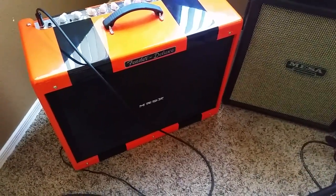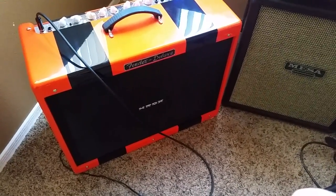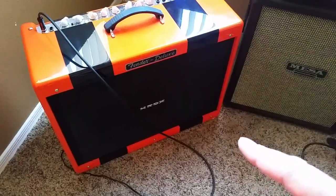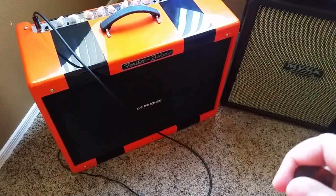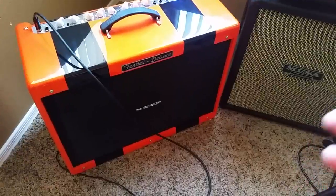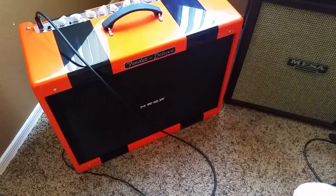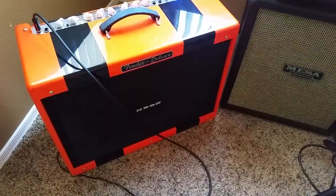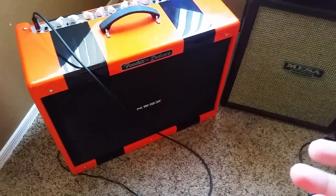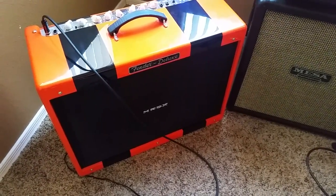It's just a good idea, and it's only $10 to $12 online. You saw how easy it is to pop in there. Obviously if you don't like it, pull it out and stick the old one back in — you are out nothing. This Hot Rod Deluxe has the Celestion in it with a hard lacquered wood cabinet, the exact opposite of the Benson which is a pine cabinet with a Jensen. So if I can mellow out this version of the amp, you can imagine what it will do to your standard Hot Rod Deluxe. There's no way I would not own a GT12AX7 for whenever I feel like popping it in. Be careful — it will burn your hands if you don't let it cool. Unplug it. Thanks for your time. Know your gear.